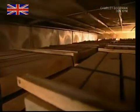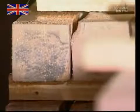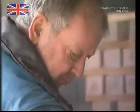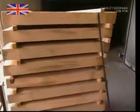These grinders are made out of beech, a hardwood that needs to be dried first. But surprisingly, before it's dried, the timber is sprayed with water. This uniform wetness ensures each piece dries at the same rate in the same way. Big ventilation fans draw the moisture out over about 6 weeks, and when the wood measures only 8% humidity, it's ready for processing into pepper mills.